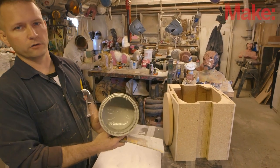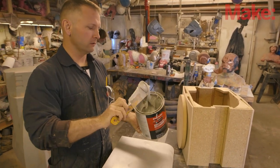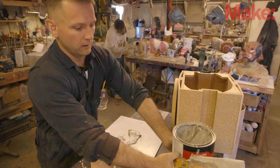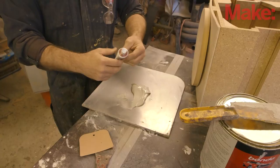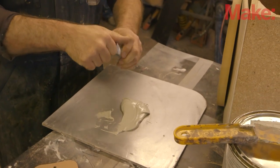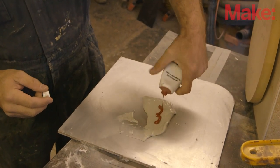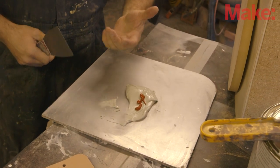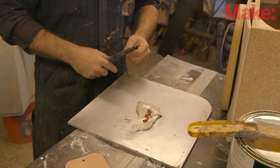We'll start. We've got this bucket of gray goop — this is basically Part A. We're going to scoop out a dollop. This particular tool is made just for scooping out dollops. That's all I'm doing with it because we don't want to contaminate the bucket with any of the actual mixed material. Next, we're going to mix in the catalyst. I'm kneading the tube to make sure that everything is evenly mixed. After blending everything in the tube, I'm going to squeeze out a bead, about like so. The ratio they give you on the can: for a golf ball sized lump of your main part, you need a one and a half inch long bead of the cream hardener out of the tube.